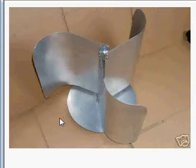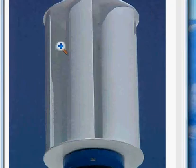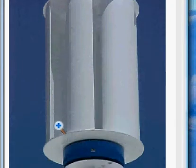Now there are other kinds of vertical axis turbines. This is a modified Savonius with three blades — maybe slightly more efficient, but not much. Another type would be something like this — still not a lift type like a Darrieus, where you actually have lift on the blades. This is still a drag type, probably around 20%, maybe a little more. If you have wind directors that focus the wind on just half the machine so you don't get as much drag on the opposing side, you can get efficiency above 30%, especially with lift-type VAWTs — possibly up to 35 or even 40% if done properly.